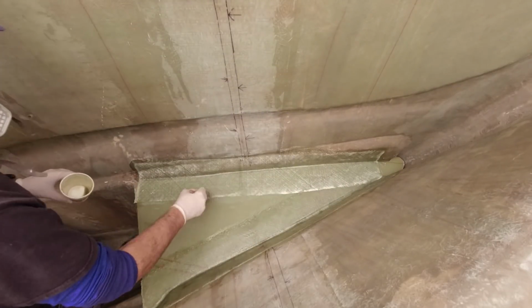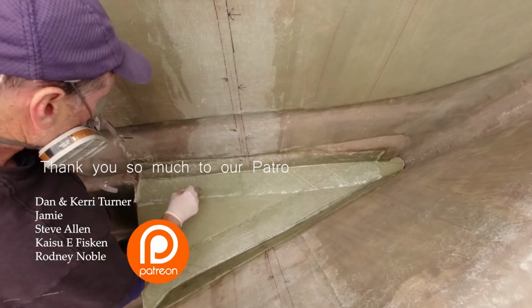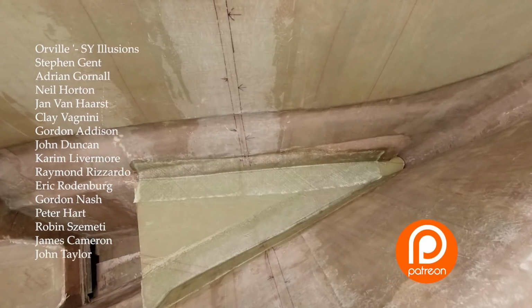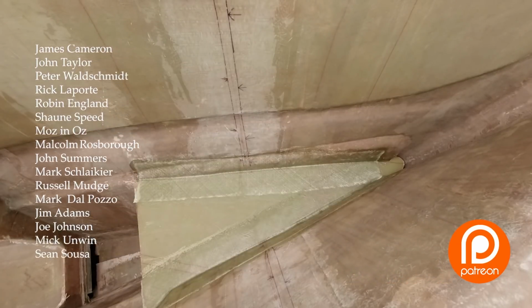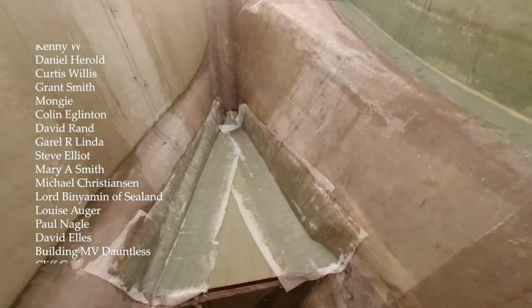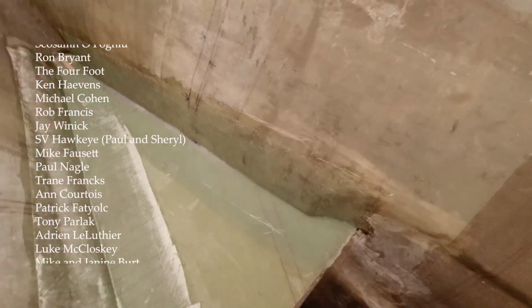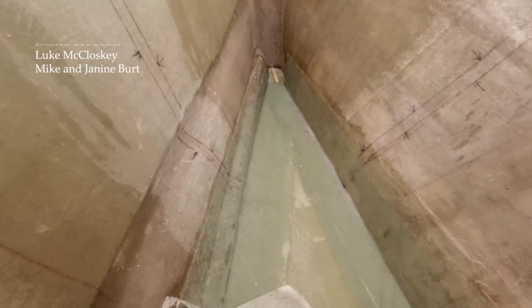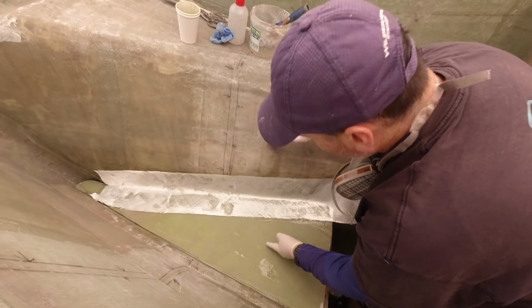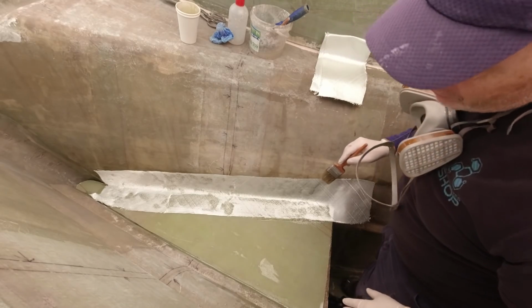There's no deviation to that anywhere that I can find in any boat building instance where you'd put down the thicker one first or the wider tab first. I think that's actually probably a little bit defeating the object of tabbing. The idea is to overlap the second one, overlap the third one, gradually increasing the roots of the structure to hold it in place. But I've seen a couple of things where guys have put the wider tabbing down and then they're getting narrower and narrower. All you're doing is thickening it up and creating a shear point. With this, I'm actually spreading to there and then to there and then to there. It makes sense as we gradually increase our foothold on the substrates, as we increase the bulkhead strength.